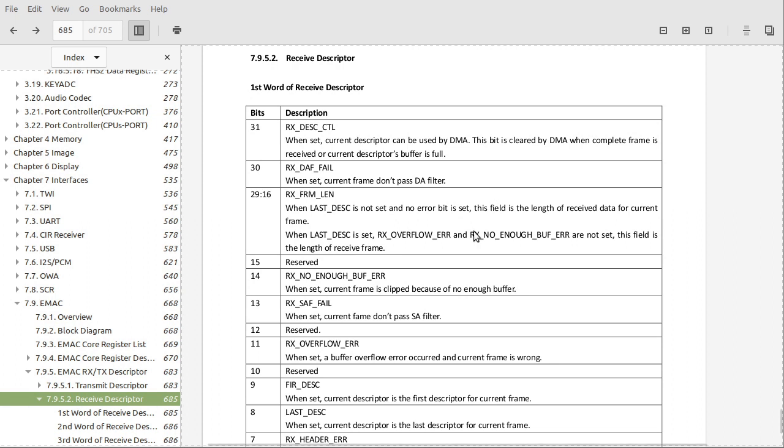So depending on how your MAC handles descriptors, you initially set up the receive ring with some flag that tells the MAC if it's available for use, and then allocate a bunch of memory blocks for it to stash incoming packets. When the MAC gets the incoming packets, it will change the status of the descriptor, add in the size of the data, and write the data to the provided memory space. In this way, if you haven't read the data and cleared the status, the MAC knows when it loops around the ring to stop processing any incoming packets until you've had a chance to clear them out.